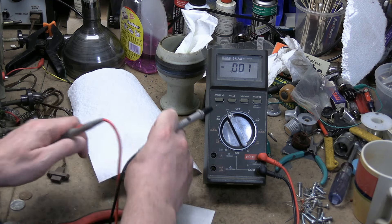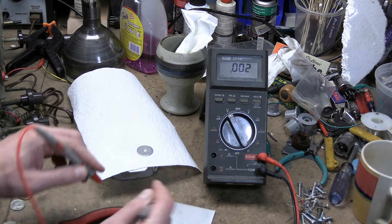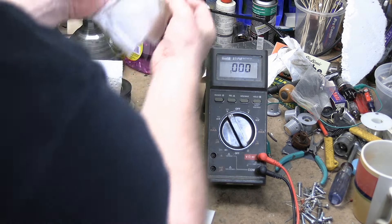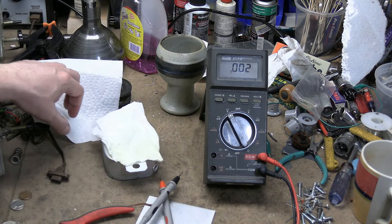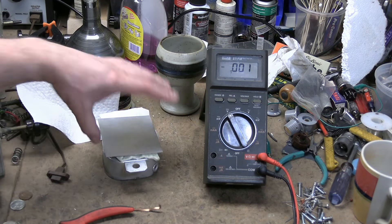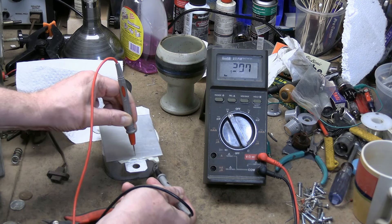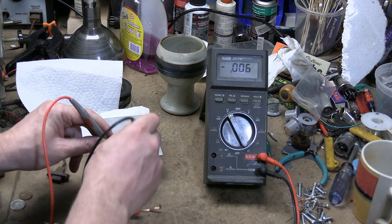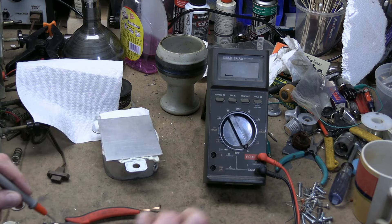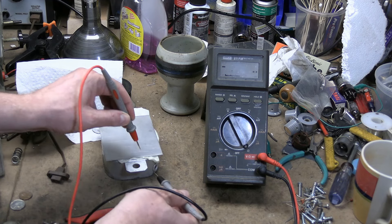Finally let's try with the zinc — barely anything. Let's try with a piece that's been dampened with some used evapo-rust — not only evapo-rust but also some iron ions. Oh yeah! 0.3 volts. And if I go the other way — negative. And if I put this in resistance mode: minus one and a half mega ohms. Similar readings, and if I go this way it will be positive.